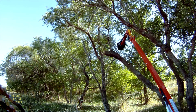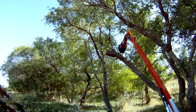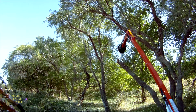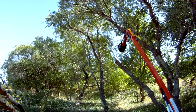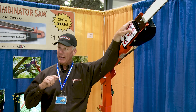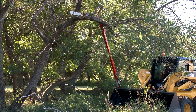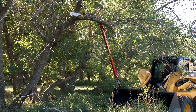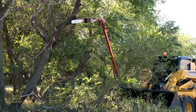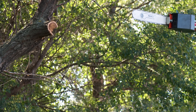The system is built with a number of common components to make it relatively easy to find replacement parts if required. The saw comes with an automatic oiling system: it taps off the hydraulic pressure side and a built-in automatic oiler lets a trickle of oil go up through into the journal, which lubricates the bar and chain. Very little oil is used because 95% of the time you're positioning the tool — the saw isn't running much at all.